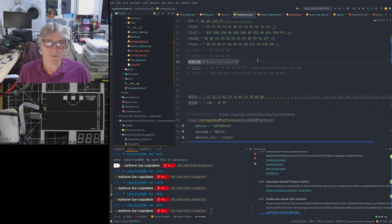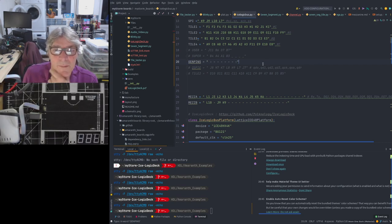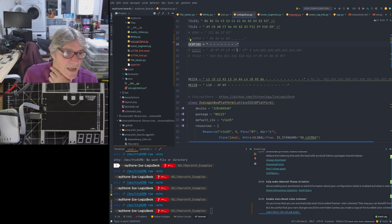The gen pins, because when you define the pinouts, you have to deal with the fact that there's a bunch of signals on the connector for the tiles that are nothing to do with the FPGA, that carry signals from the STM32, such as the I2C signal, reset, enable, and the mixed signal pins, such as the ADC/GPIO pins. So we have to account for those in our pin configurations. So those are considered kind of don't cares or ignore these from the Amaranth point of view.